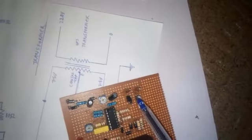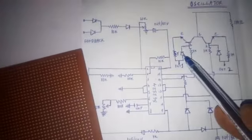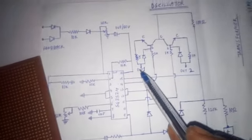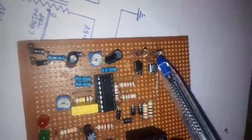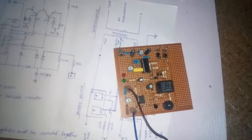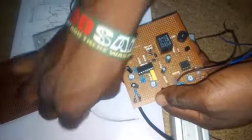I used a 1K resistor here — actually I used 1.5K and it still works. This is my first transistor. If you follow the circuit exactly the way I have it here you will get the same result. From here I have a diode and a 1K resistor connected together, giving me output one. And here I have another diode and 1K resistor giving me output two from the oscillator. My output one and output two will then be connected to the MOSFET driver.